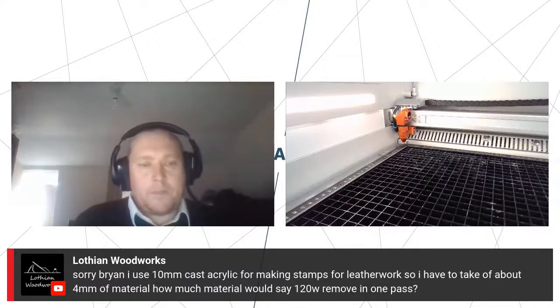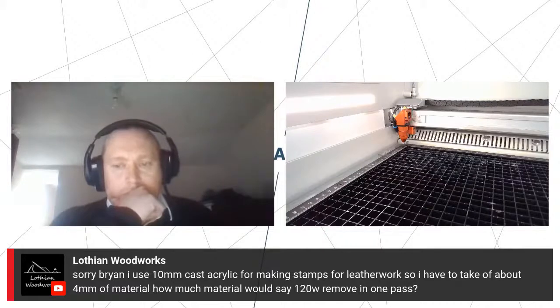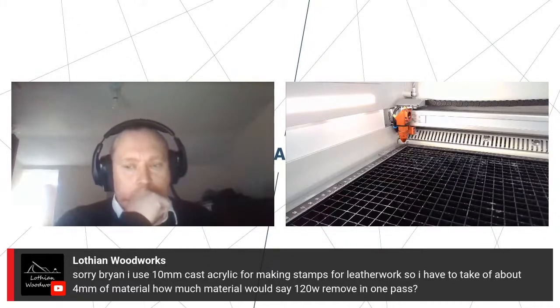It's the laser slightly differently. So if you're using CNCs, for example, you could set the depth. Obviously, using the tooling, we don't have that ability. We use power and speed settings. So a little bit of trial and error to find the right setting, but we can plug that into our database to save it for future. But I think I'm with you.